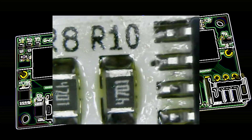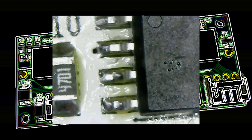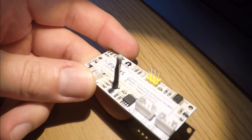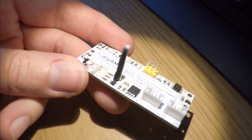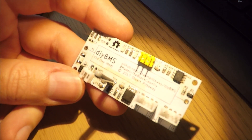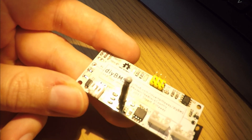These are always the troublesome areas — the pins on the chips — but that's looking very neat and tidy. That's the ADUM chip. So the only thing left to do now is to solder on the remaining components, which are all through-hole components, so they're very easy to do. And then you can test it. Don't forget that the positive and negative battery terminal on this is around the opposite way to the other circuits — that's really important.